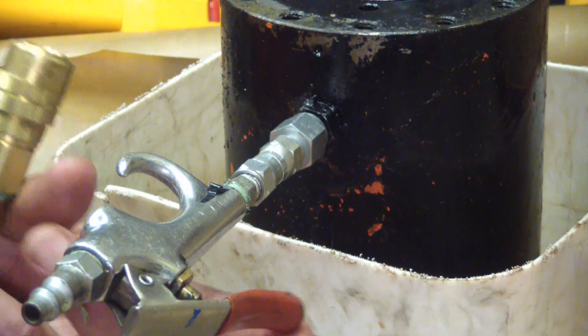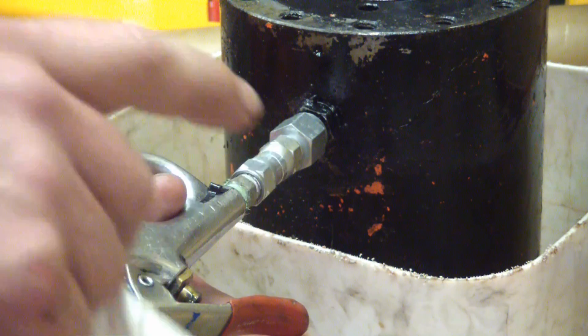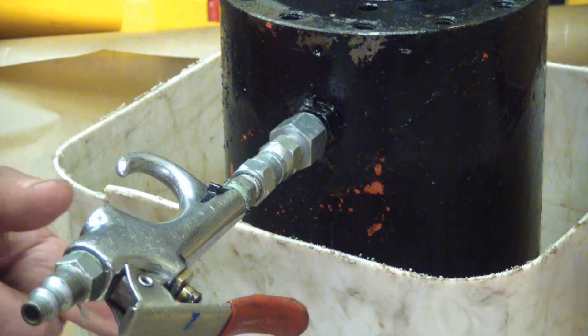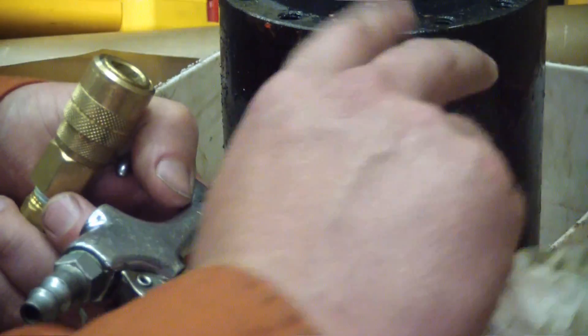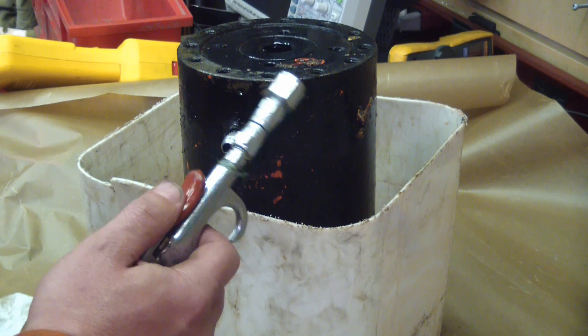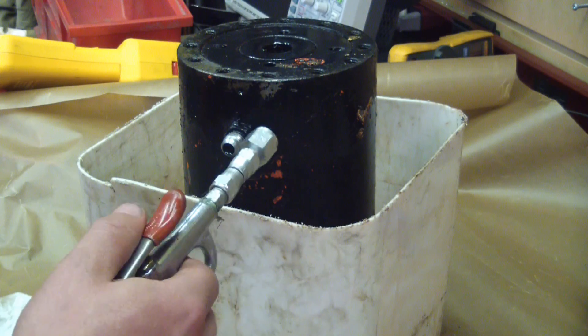You'll note this is still pressurized with air. The dangerous thing about doing hydraulics with air is that when you're actually working on hydraulics, it's essentially an incompressible fluid. If you have air in there, air is a compressible fluid, so you're essentially putting a spring in there — pre-loading a spring when you're jamming it full of air. Gonna have to go with plan Charlie. You bring a pea shooter to a pillow fight.